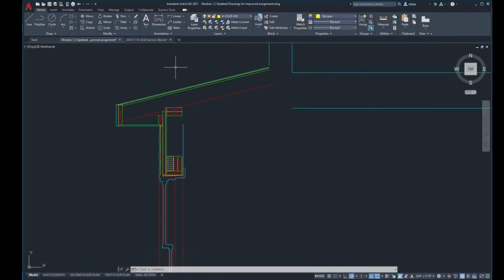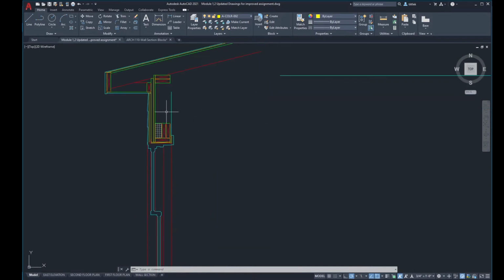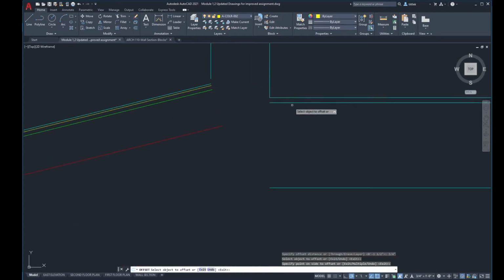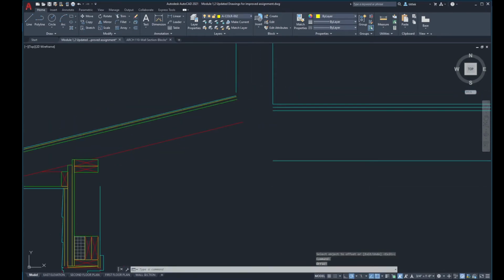Next thing I want to tackle is this interior soffit. And that interior soffit drops because of this beam. So if we think about this, our second floor is offset 3/4 of an inch. There's the top of my subfloor. There's the top of my joist, offset 11.25 inches for my 2x12. There's that, and then this should be 1/2 of an inch for my ceiling.